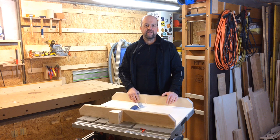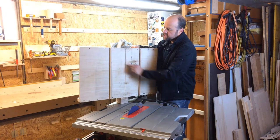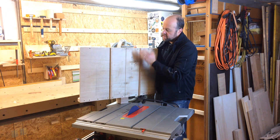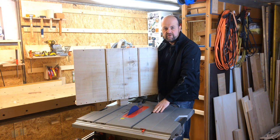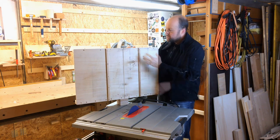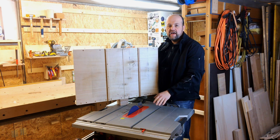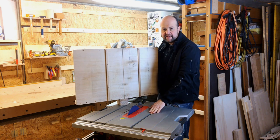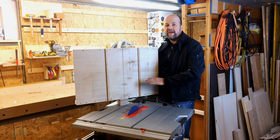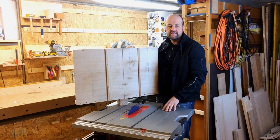The first important thing I learned is that it's quite difficult to get the runners just right. I used slats or cleats made of beech, and it's very difficult to get them to just the right width so that they glide smoothly in the grooves without too much play. The method I used was cutting them on the table saw to about a millimeter wider than needed, then using a hand plane and checking fit every two strokes — going back and forth between plane and saw — until they didn't have too much play but slid well.